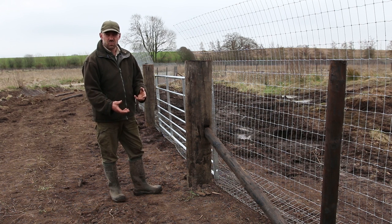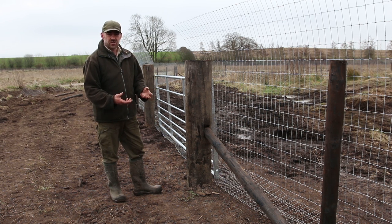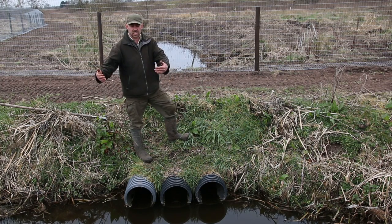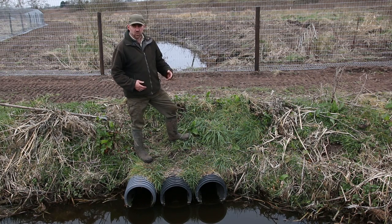For most of the jobs we've done in much harder ground, we generally use five-to-six-inch or six-to-seven-inch strainers at 2.4m with points on them. When going into dry gravel pits or hard ground they're more than ample because the ground is rock hard around them and supporting them. Here we've also had to use 2.1m intermediates because the ground is so soft and they're just sinking straight down. If the ground is hard, we normally use 1.8m intermediates. So it's something to bear in mind - think about your ground conditions. Obviously this gate needs to be clad and we'll go through that later.